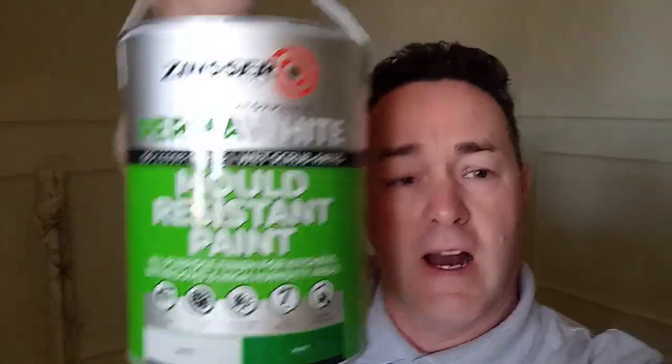I have to say what brilliant stuff that is. I gave it three coats on the ceiling. There was a bit of filler, so I spot primed where the filler was, and then I gave it three coats of this because there were some plasterers' patches that had been done. But that paint — I'll be using that again because it went on a dream. It covered nicely. Obviously where there were dark bits of plastery it struggled a bit to cover for two, but I was giving it three and it went on beautifully.